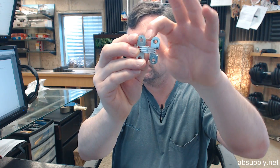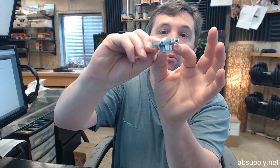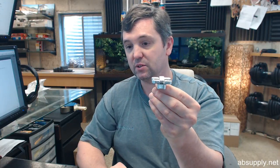This profile has a body width of half an inch, so that is super easy — you have got a half inch prep. When I install these, first of all I would use a template created for doing only this. I would mortise the body; you can use that same half inch bit. Then change the depth of the bit and go the full width of the faceplate — that is how you will end up installing these. The link to the cut sheet will give you all of the important dimensional properties.